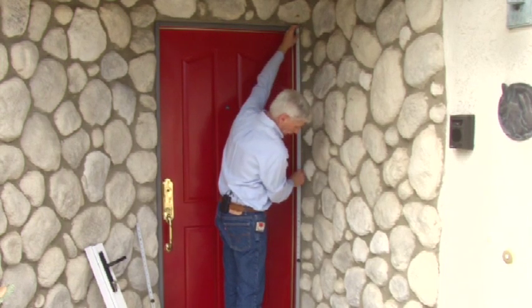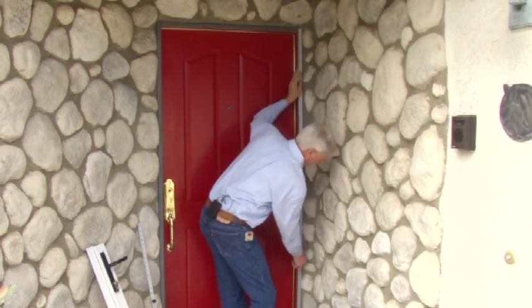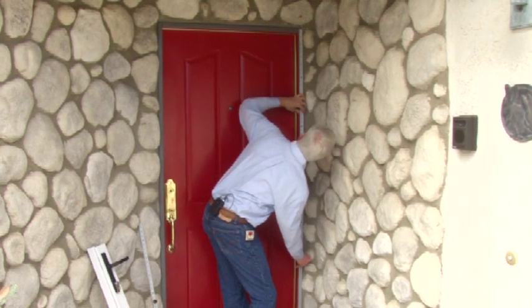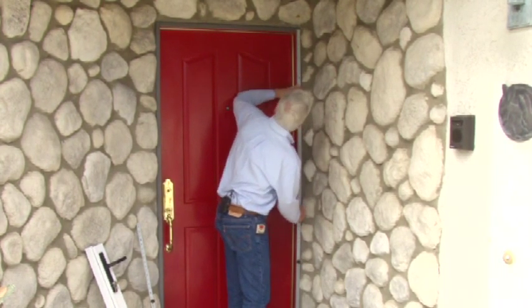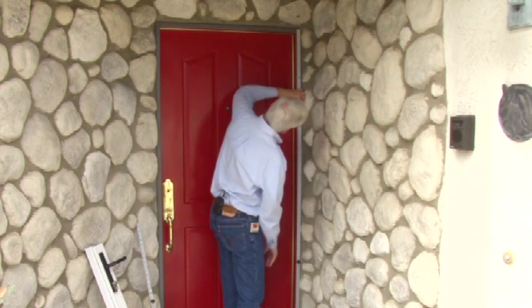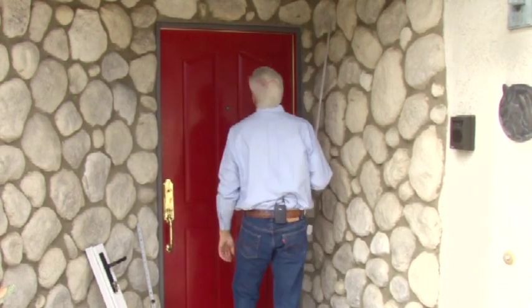And I'm even here, and although I'm sitting on top of the concrete there a little bit, and I'm not up against the wood trim, I'm going to shorten this up just a skosh, because it's a little bit too long if I did it at 81. So it looks like this measurement here is going to be 80 15/16. And we can actually make that door to that dimension.